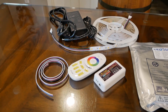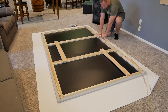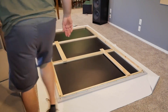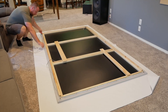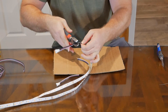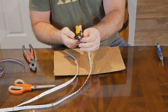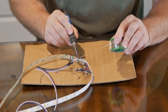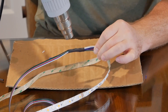Here's a quick shot of all the components necessary for the LED lighting — I'll leave all the links in the description below. To start out, it's a good idea to map out where you're going to place the LEDs, including where the ends will intersect. These strips have quick-disconnect ends that allow you to add more strips, so no soldering is required in most cases. In my case, I chose to solder the ends to a common input and have the strips meet in the opposite corner. I cut the ends off each strip and soldered them to a few feet of extension wire with a quick disconnect on that end to make one input for both strips. This allows the screen to easily be removed and disconnected if needed. The extension wire I got ended up having quick disconnects already, so this was the only soldering that needed to be done.